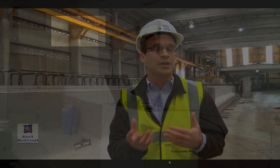The columns are pre-cast and have a steel knee provided for the gantry girders — the gantry crane runs on the beams there. This is a common feature in all pre-cast elements: they have to have a lift-in arrangement. You would have seen forklifts going around because all these elements are rather heavy, although they are considered light per se.